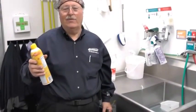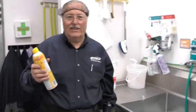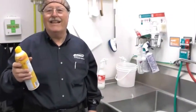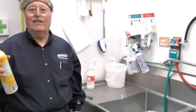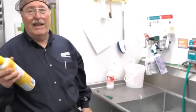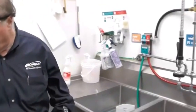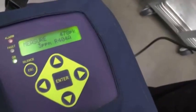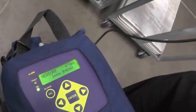We're in the bakery department doing leak checking. One of the things you want to keep in mind is some of the release agents used on baking trays have a propellant in them which is very similar to 134A. I'm reading just a little bit of background, so I'm going to spray some in the sink to show you what can happen — this could actually set off anybody's leak detector because it is a refrigerant-based propellant. I put a little bit of the release agent in that sink, stuck my leak detector down in there, and I actually got four parts per million. It went back down as soon as I came out of the sink. So your pan release could be giving you a leak signal — it's not really a false positive because it is refrigerant, but it's not a system leak.